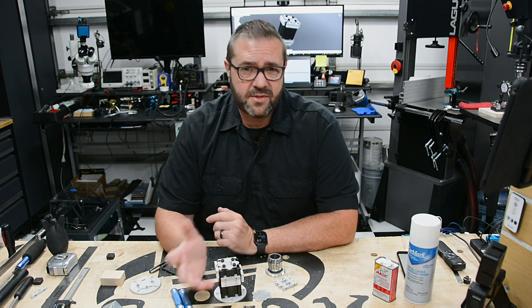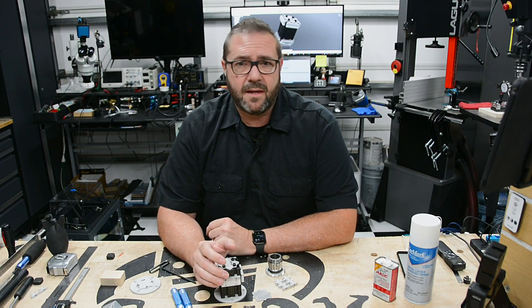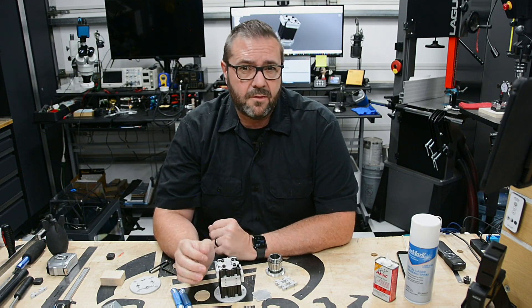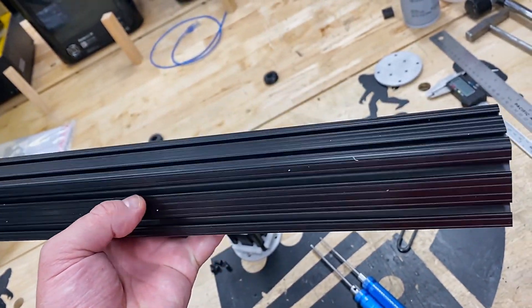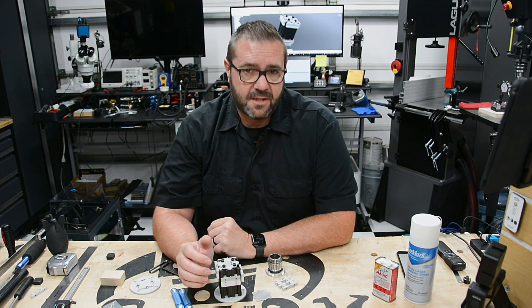The main concept here was that while most tombstones are milled from billet aluminum, the volume required to mill them is pretty big and, as such, the cost to have one milled is equally high. My thought was, rather than milling it from billet aluminum, a quad T-rail extrusion could be used as a tombstone to save lots of money, offer lots of options, and still be rigid enough to handle the forces of this machine.